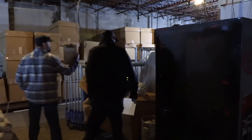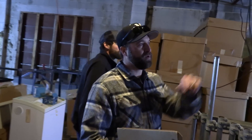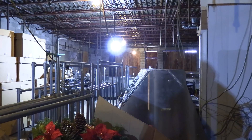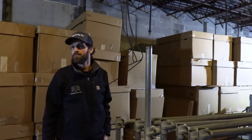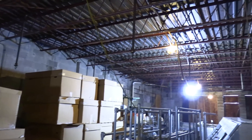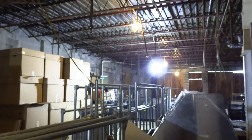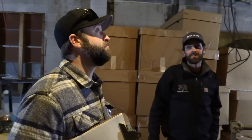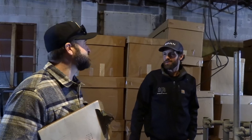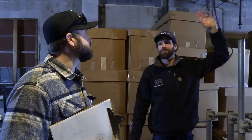This space here will split down the middle — at least the plan now is two retail over here, one retail on the other side of the block wall. Just white box so that whoever's looking to start their business or move to a brick-and-mortar can do so. What do you think about the ceiling treatment — drop ceiling or leave it exposed to the deck? Originally we're thinking drop ceiling, but with the square footage it's like fifteen thousand dollars just in cost. If we can clean it up and paint it — you see all the chains go in that direction: Chipotle, Qdoba, McDonald's. And if you're replacing the roof, you can get your R-value on top through the foam.